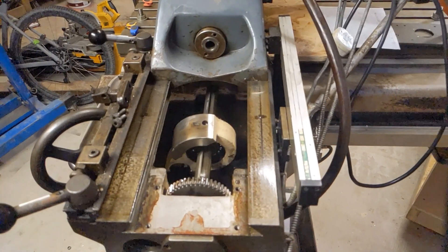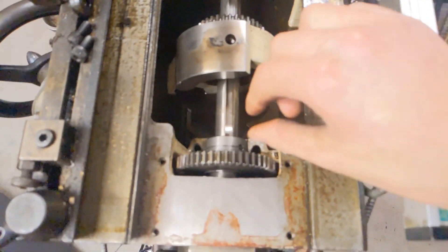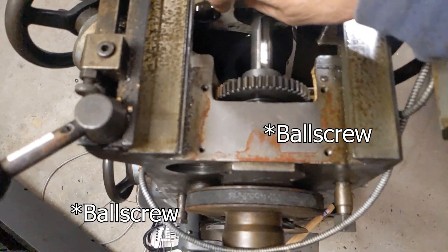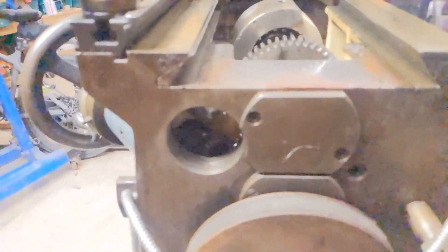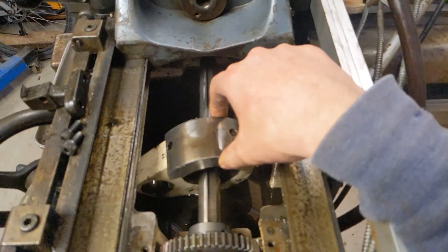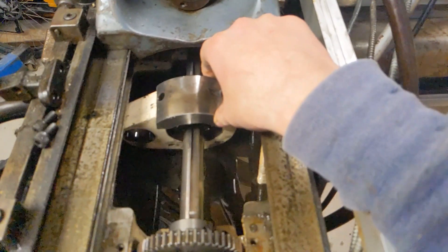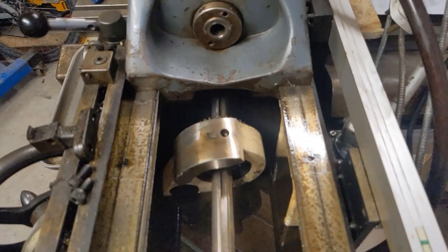Here's what's inside the gearbox. This is the slide that gets pushed along by the linear screw. The linear screw sits just in this bit here and runs along there — hence this hole at the back, that's where the linear screw goes. This is also where the spindle's power gets transferred from. What I've got to do is get all this out because I need to re-adapt this big casting to fit the new ball screws. And even once I've done all this, the Y-axis motor is probably going to struggle to fit anyway.